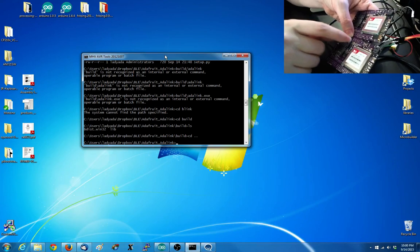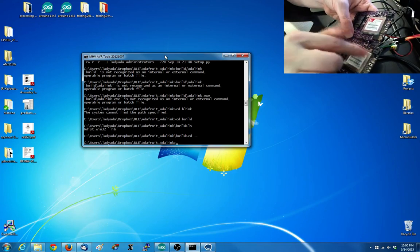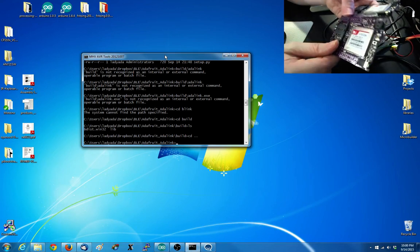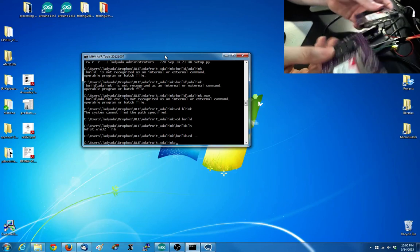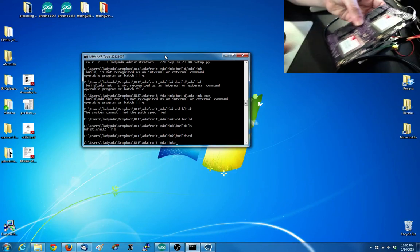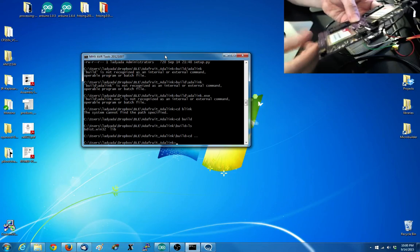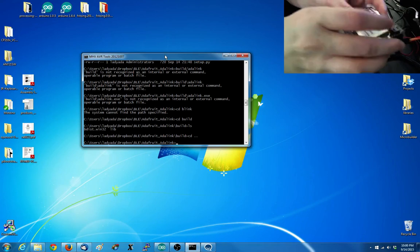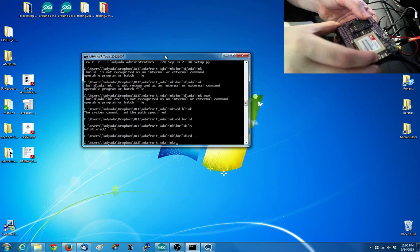What we do is we paste down using a little syringe, we place all the parts, and then we just put it through the oven in between other ovening type stuff. So I got two of these. They're probably good to go. I pretty much took the breakout version and shifted it into a shield. Of course I still have to test it, so I'm going to set it onto a Metro and do that.